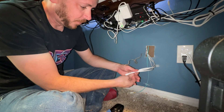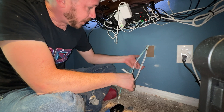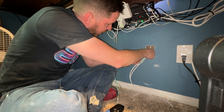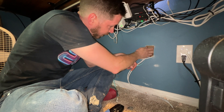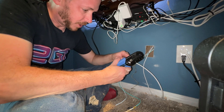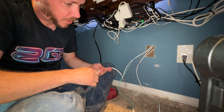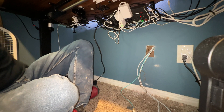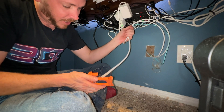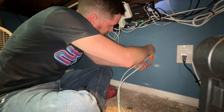We've got three cables here and some fiber, which I am not going to accidentally crush. On the other side of the wall is our guest room, which is eventually where we're going to move my wife's desk. So a little future-proofing — I'm going to leave this line in there, and when I want, I can cut a hole in the other side of the wall. For now, since we have two computers in here, we are going to crimp two cables. We're going to leave the others flying in the wall in case we decide to pull even more cable down.